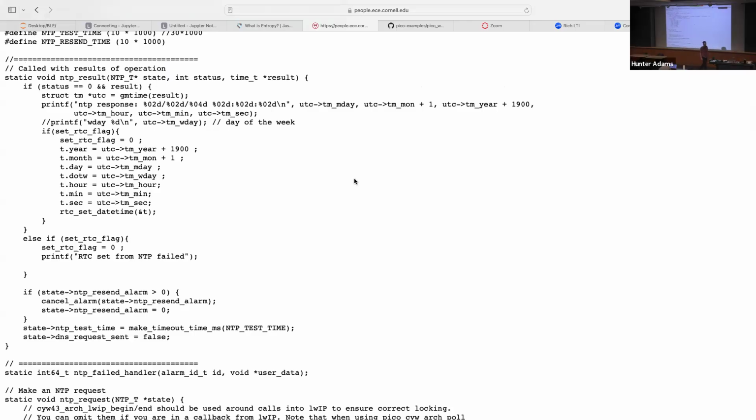And then, as you might expect, within the hardware API for the real-time clock, there exist functions that allow you to read the time. Tell me what year it is. Tell me what month it is, etc. So once you've set the real time once, it then manages that real time for you into the future.